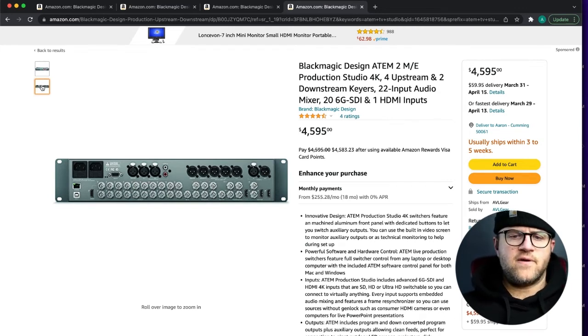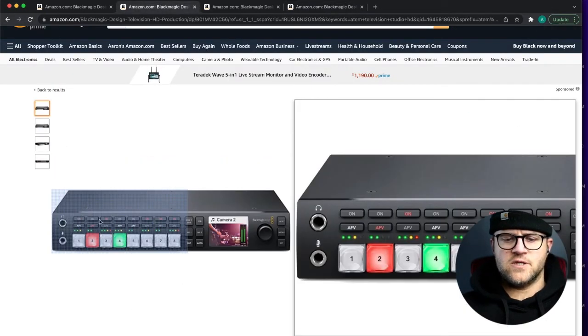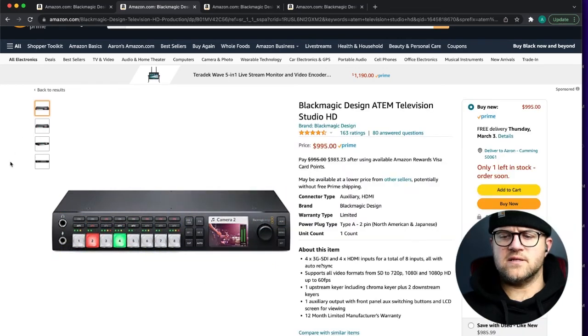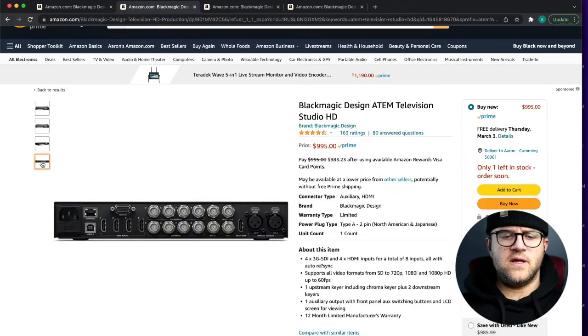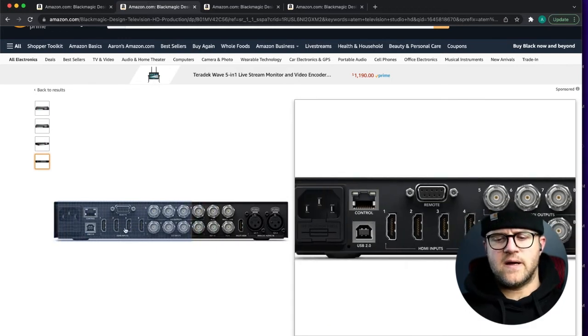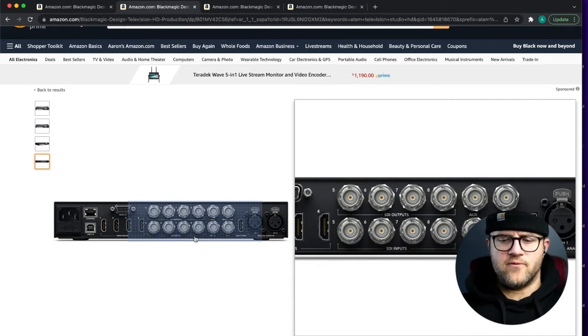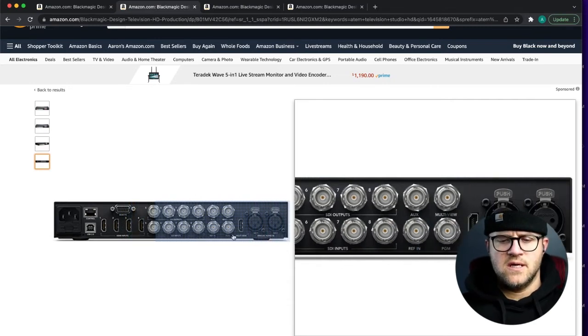We do have at our church a 4K version of this box. That's the HD version does come in. You can find it still. I don't know if they still support it or sell it, but they do have a version of the Blackmagic one rack unit version, 1ME version of that does 4K, but also has HDMI inputs as well as SDI inputs, which I think is super helpful for most churches, as many more cameras, especially affordable cameras, have HDMI outputs rather than SDI outputs.